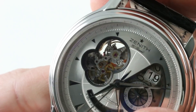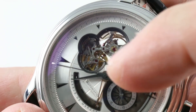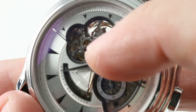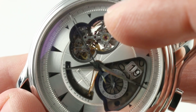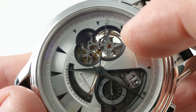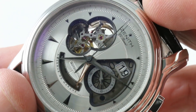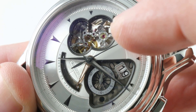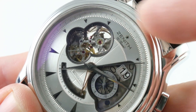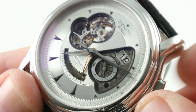Let's take a look at the movement. The caliber is Zenith 4039, and it features a special series of bridges. You can see the fourth wheel with a tri-spoke pinion acting as the constant seconds. After the fourth wheel comes the escape wheel — you can see the anchor oscillating away and even the translucence of its violet pivot zones. There's another fully skeletonized bridge for the balance, beating at 10 beats per second because it is an El Primero caliber. The bridges have been fully perlage engine-turned — a thoughtful detail — and a blackened aperture showcases the mechanism in the same blackened character as the Dauphine hands at center and the indices on the dial.